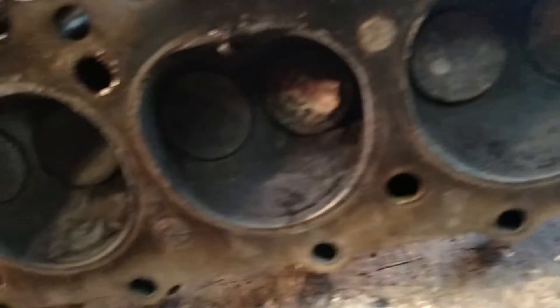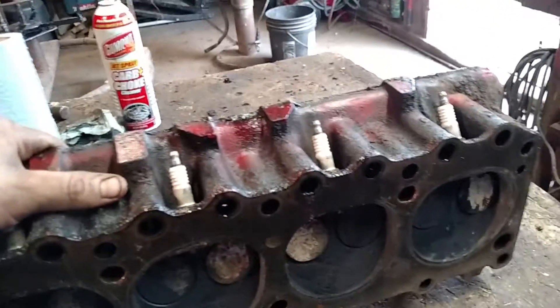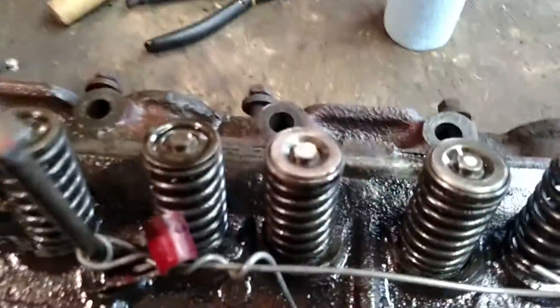There's the head. Actually, the head is in real good shape. As you can see, it doesn't look too bad — kind of dirty, but everything's just worn out, that's why it looks like that. I'm going to take it and have the valves ground and gone through so that's all back to good running condition. I'm not certain if the valves were ever replaced.